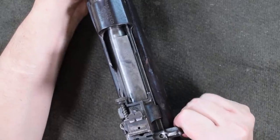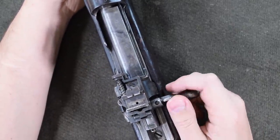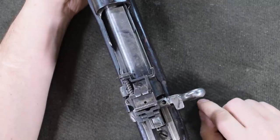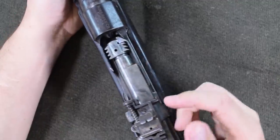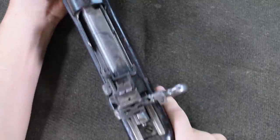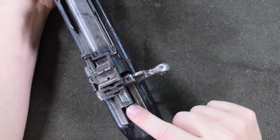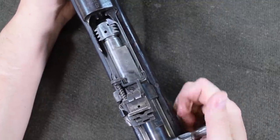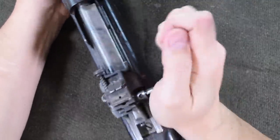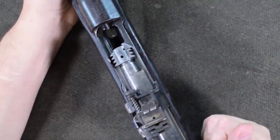The action is very firmly locked up because the cocking piece can't move. Let's go ahead and put this together wrong again. With the bolt head improperly assembled, if I close her up and then go to that same neutral position which should lock the cocking piece — look what happens. Now I can open her right up. That's because she's in no way locked and we're not having to go through an unlocking cycle in order to open her. This is an unsecured breach.